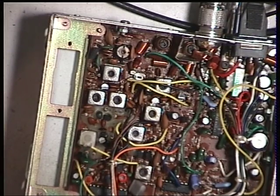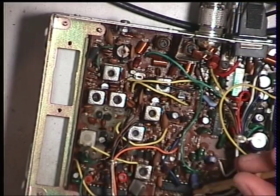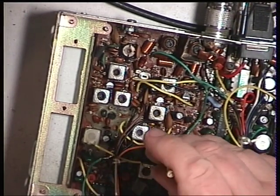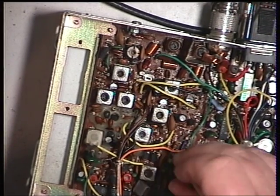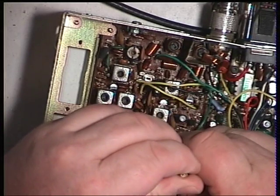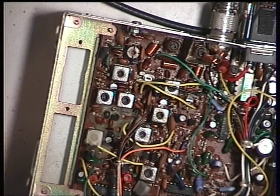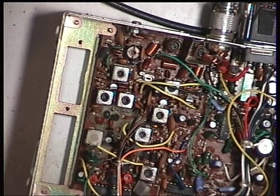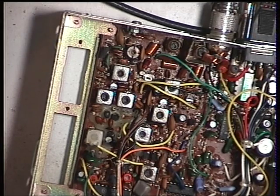So we need to adjust the squelch preset, which is RV101, in the middle of the set here, until it does come back in — subject to being able to get the tool into the component. We'll now do that test again: signal generator off, squelch to threshold, signal generator on and it comes in, squelch control to full on the radio, adjust the attenuator. It's coming in at 100 microvolts, which is S9, and that's absolutely ideal.